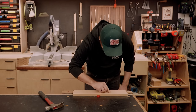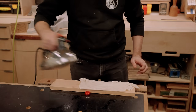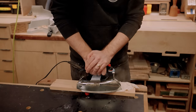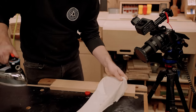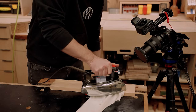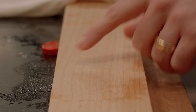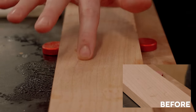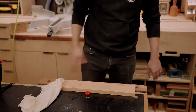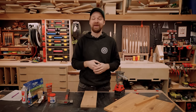If you break the fibers you can't quite do it, but most dents will actually come out. Using a regular clothing iron, lay a wet cloth on top of the wood and apply heat — it will steam it out. It's almost gone; that's definitely sandable at this point. Just a tiny bit where we tore the grain, and a little sanding would take care of that too. I've actually found over the years that a wet cloth with warm water from the tap works pretty well too.